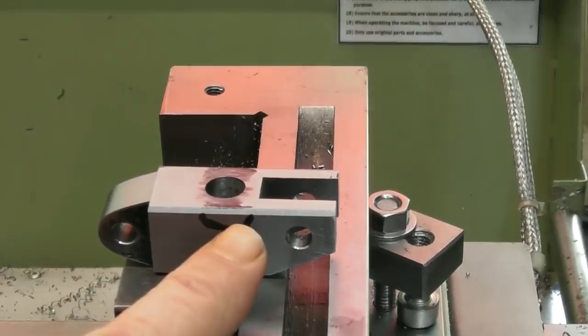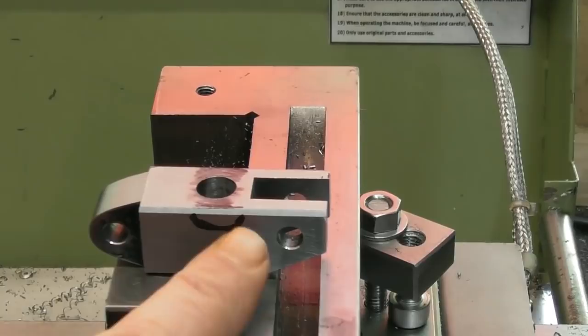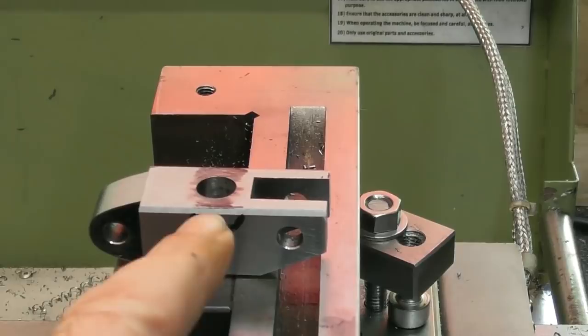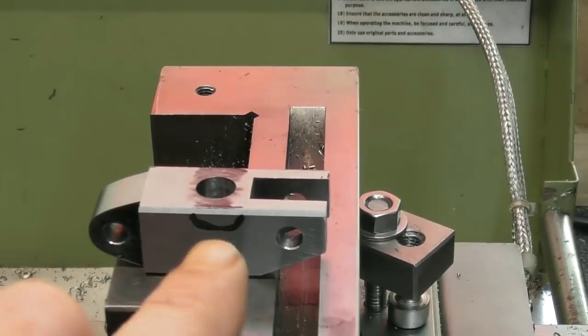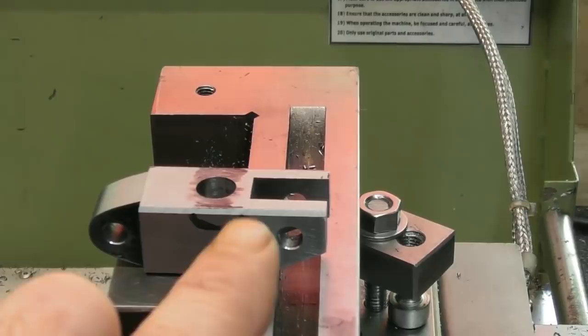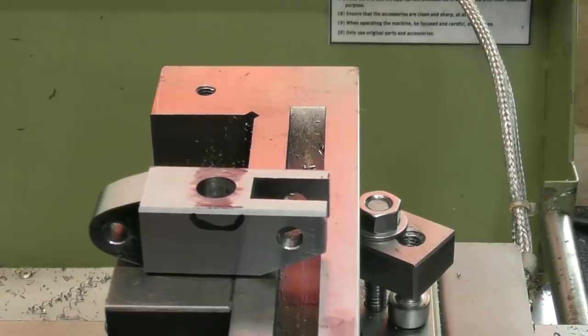For my top pivot, I want to have a 12mm diameter semi-circle machined in the top of here, again at the 28mm back. I'm going to then machine a piece of brass at 12mm diameter, again with a 6mm clearance hole through it, and machine or file it through its halfway point — so it's a semi-circle of brass. It can be a little bit over a semi-circle to fit into this pocket. I need to machine basically half a hole through here, and I'll do that with a 12mm milling cutter, since I'm limited on milling cutter sizes.